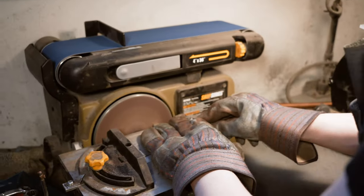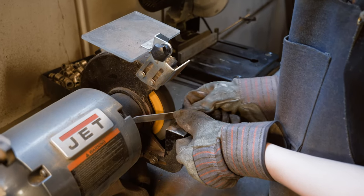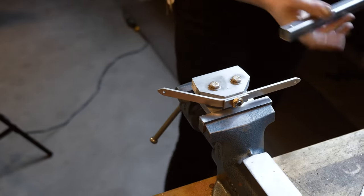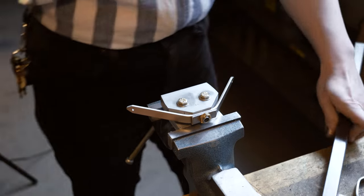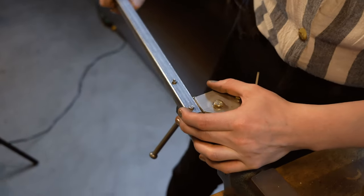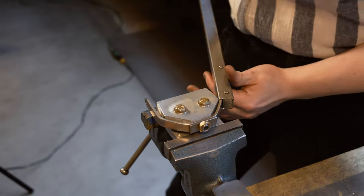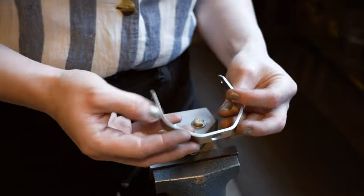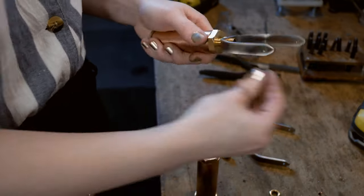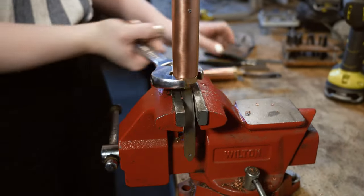The brackets, which stand above the body and hold the capsule, are sanded, polished, and deburred. They're then placed into a bending jig and shaped by hand with a bending bar and mallet. The bodies are attached to the brackets with a brass connector and nut, and the piece is placed in a vise where the whole assembly is tightened using a wrench.